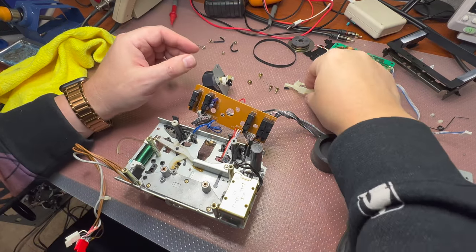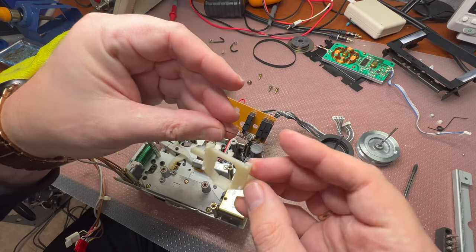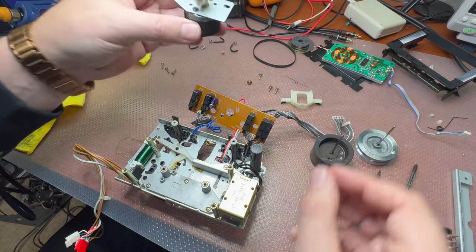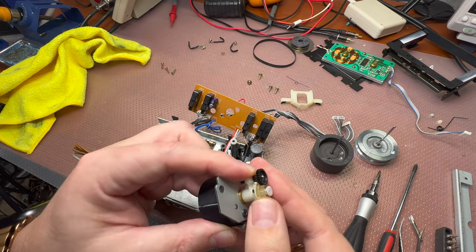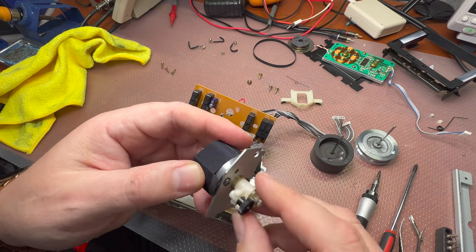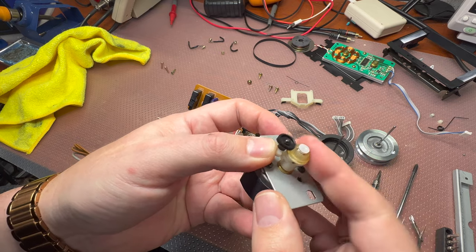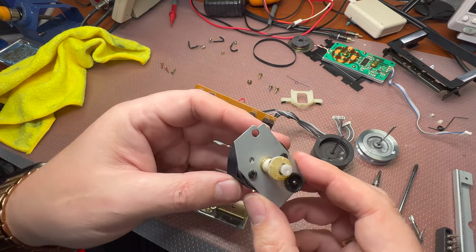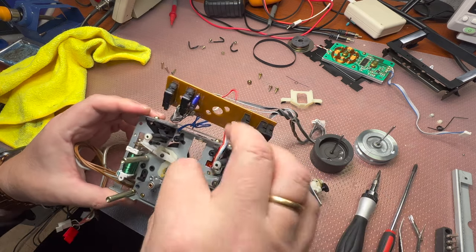Okay, here I'm back. I just removed these white brakes. You see brake pads here and the spring which goes right here. And when it's installed, it just pushes the brakes back. And here is our motor, which we will be servicing, because all gears here are good. The only thing is that the motor is not free, but the gears between them roll a little bit tight. Okay, probably I need to see and clean up the lubricant here. Maybe the motor is good, so I will check it when I remove the gears. And I need to clean up lubricant in all other places.